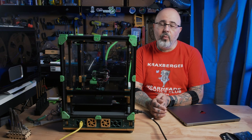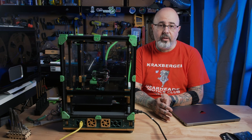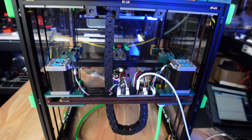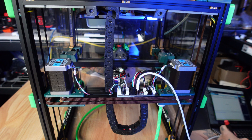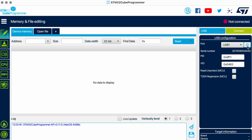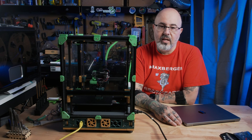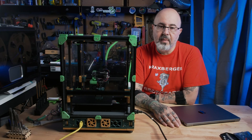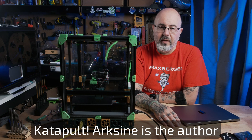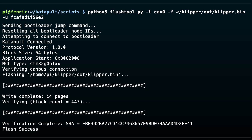After stepping away from the project for a little while, I had finished the physical installation and moved on to firmware and software. The first thing I did was power up the GBB-15 from the Micron's power supply. While plugged into the USB port of my laptop, I put the board into DFU mode by holding down the boot button and hitting reset, then launched the ST Programmer software. The board had already been programmed with CanBoot, but I couldn't see it due to a bus speed mismatch. So I rebuilt the bootloader in Katapult with the correct speed already set up in my CAN system, flashed that, then built the Klipper firmware and uploaded it. Lo and behold, I had a working CAN board.